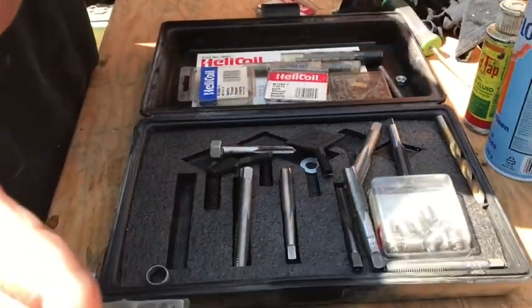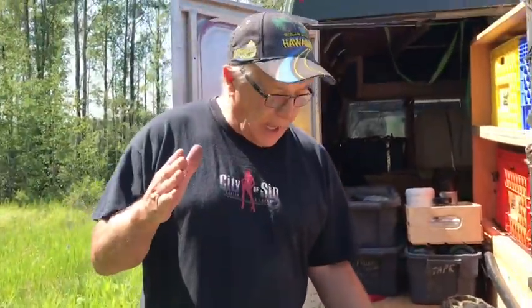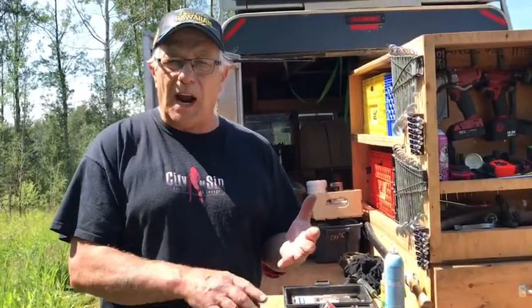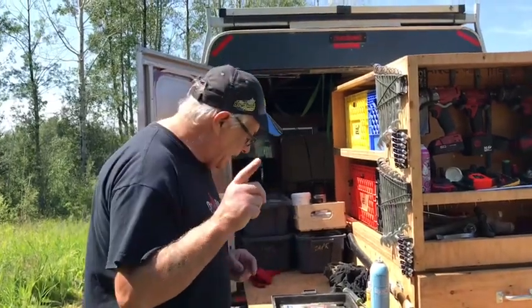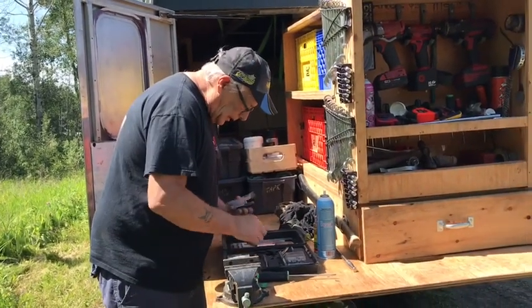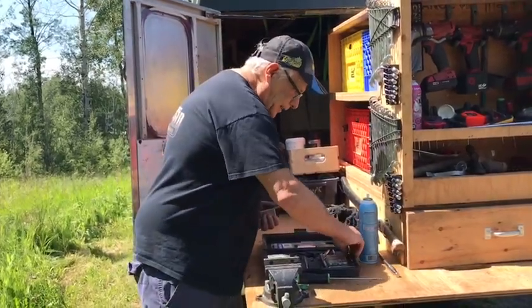You can do anything. Now, for people like Paul that don't have a Helix Coil kit, I call it Helix Coils, they got a whole bunch of names for it. AutoZone, O'Reilly's, any automotive place like that, and you could buy a kit. Now you can buy different kits. You can buy a kit that comes with the tap, the inserter, and the drill bit.